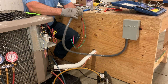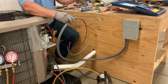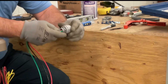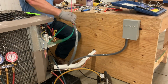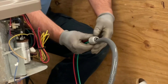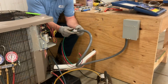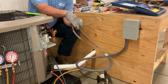I do not want that 90° fitting that was on there. I'd rather have a straight fitting that comes straight over and makes a nice clean shot straight up into the control cabinet. So I went and got us a half-inch straight connector, and I'm going to feed that through. We want to thread in from the non-thread side down to the fitting. I missed the ground wire — for this one we just have to loosen up this nut. We'll snug it all the way, seated all the way in, tighten it back down, and then take off the retainer nut and set it out of the way for now.